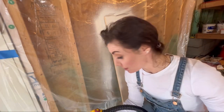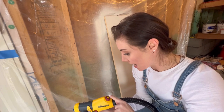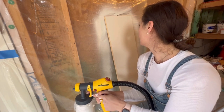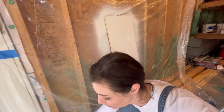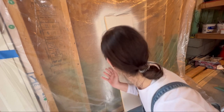Thank you, Christina from Pre-Distress, for your video. So I'm doing it at about a 5. I had to make sure my nozzle was down and I've got a medium amount of paint coming out and that's looking much better. So now I've got another cabinet I'm gonna test it on, not an actual one, but one of the ones that I tested the colors on, just because I wanna see. This is just a piece of plywood.